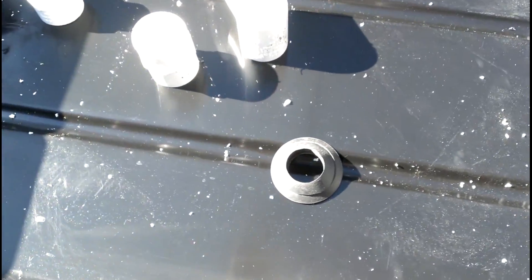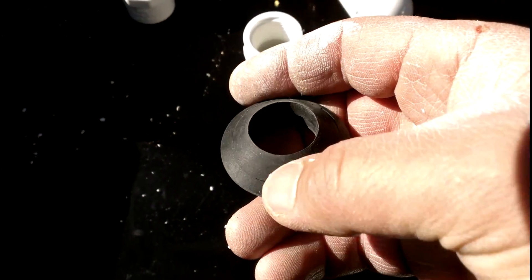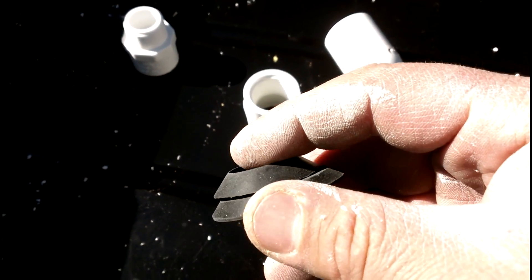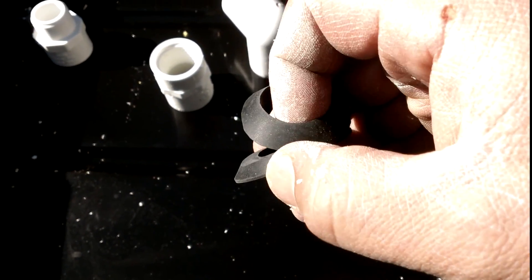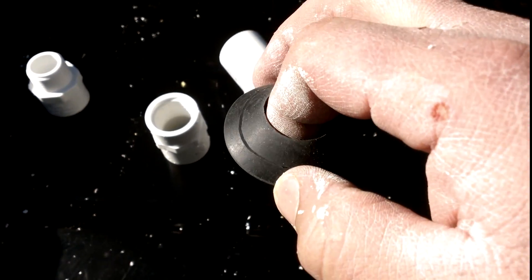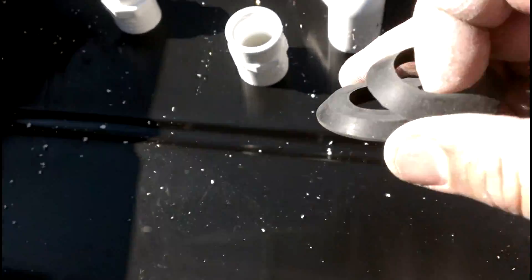Here's my tip: this is called a toilet fill valve gasket. I cut it with a utility knife. These are really inexpensive at a specialized plumbing supply store — they're hard to find at Lowe's or Home Depot, so go to a dedicated plumbing place and ask for the washer that goes on the bottom of a toilet fill valve. They may have different kinds; this one is a little thicker so I cut it in half, which gives you two gaskets.